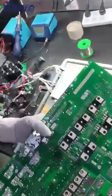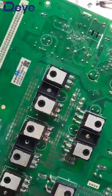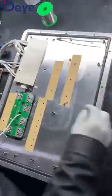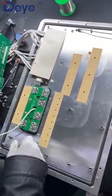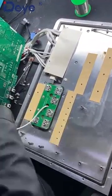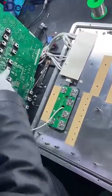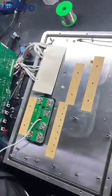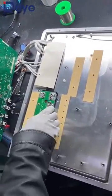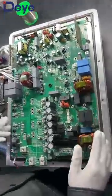This is the main board of the five kilowatt hybrid inverter. This is the label — when you take out this main board, you need to take a photo of this label. It's very important. This is the isolation paper — it is used to isolate the IGBT and the heat sink. When you replace the IGBT board, you need to make sure the isolation paper is in good condition. If it is broken, it will damage the IGBT. There is also one insulation paper here. This is the transformer and the inductor. This is the heat sink of the five kilowatt hybrid inverter. Okay, we made it. Thank you for watching.